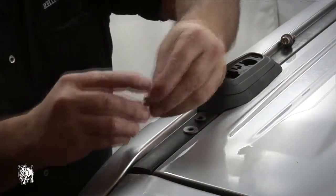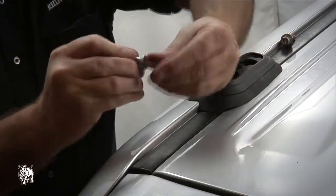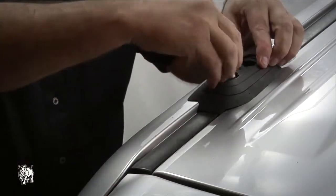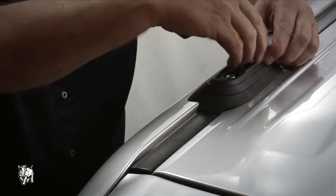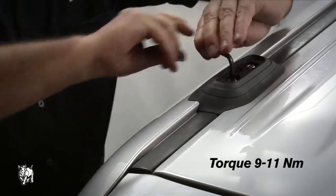In order, place the spring washer, flat washer and O-rings onto the M8 by 40mm security bolt, pushing them up to the head of the bolt before locating into the mounting pad. Tighten all M8 bolts using the 6mm Allen key supplied. Do not over-tighten.